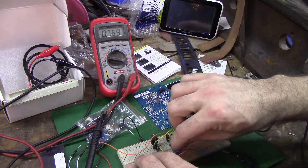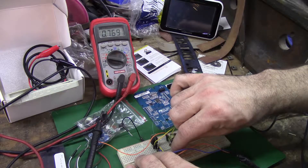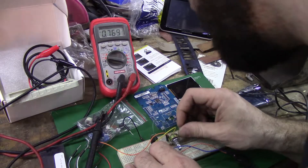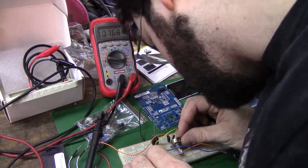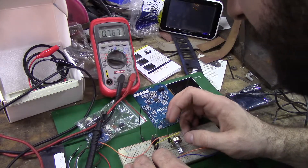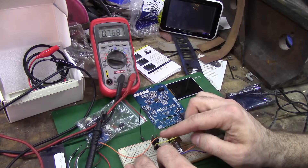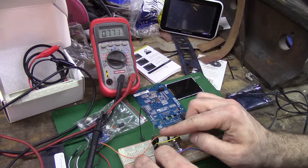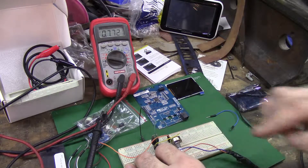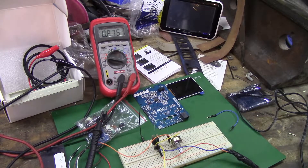It would help if I have it pushed into the right part of the resistor. That's still making no... whoa, did I see 7? I see flickers - things aren't working right. Do I have everything in the right spot? Yes I do. So I got lead to V in, lead to V out, resistor between V out and adjust. I don't have any smoothing capacitors or anything else.